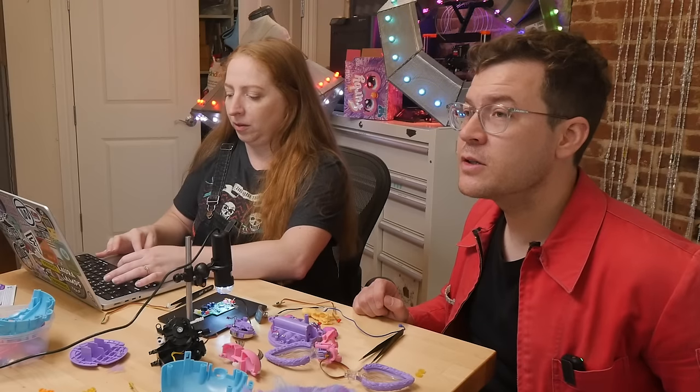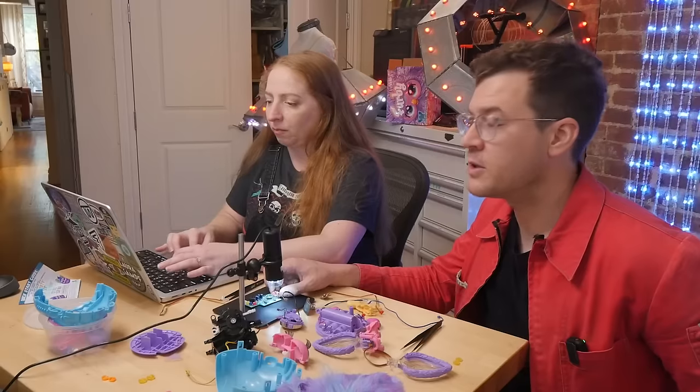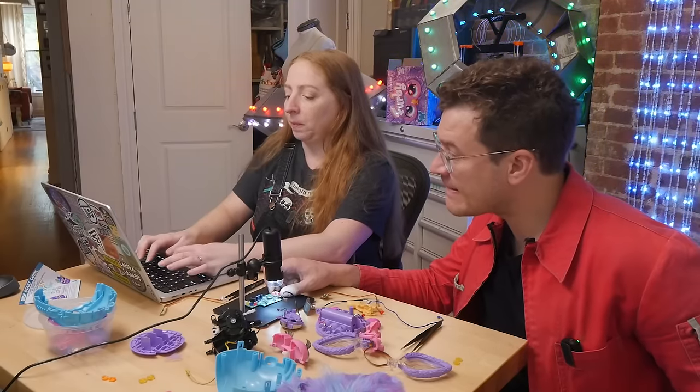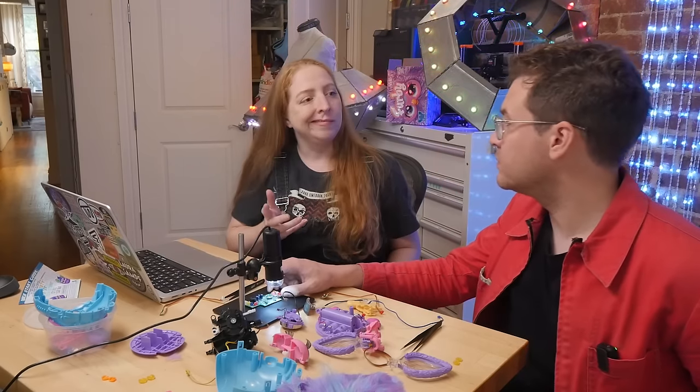The identified chip is a 32 megabit SPI quad IO 133 MHz flash memory. What does it need flash memory for? It stores sound — it stores your microphone audio to analyze it, and it also makes sound, so you need to buffer sound playback.